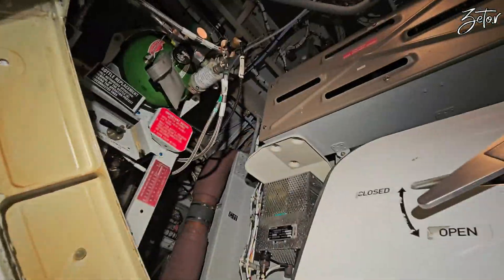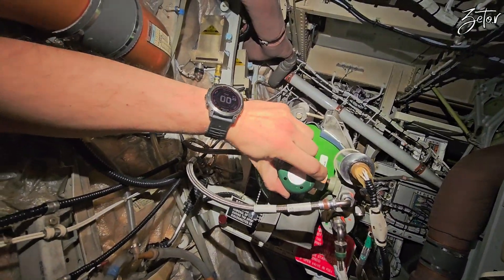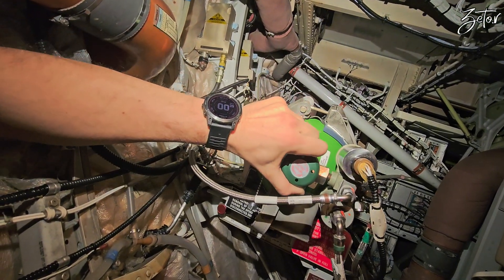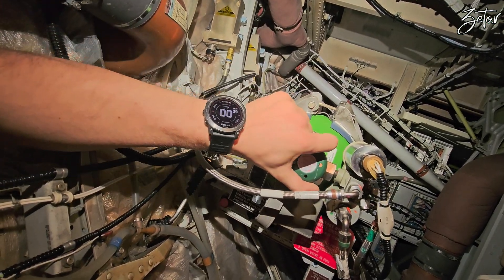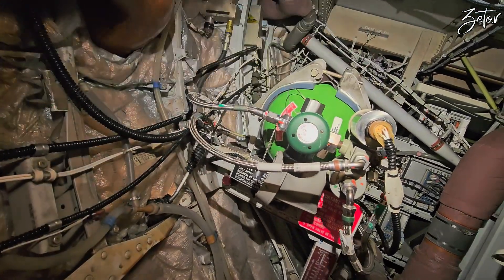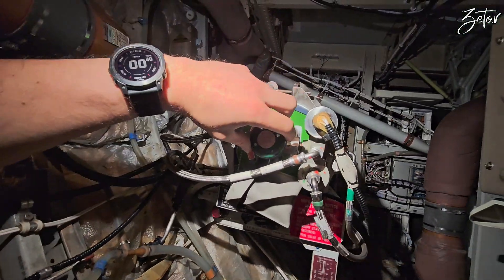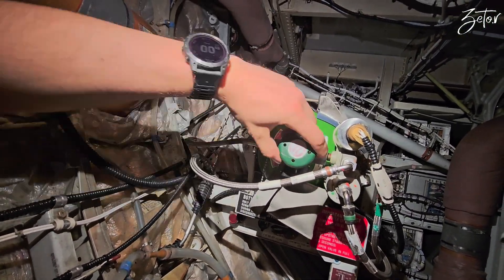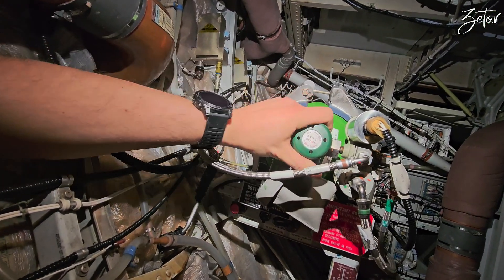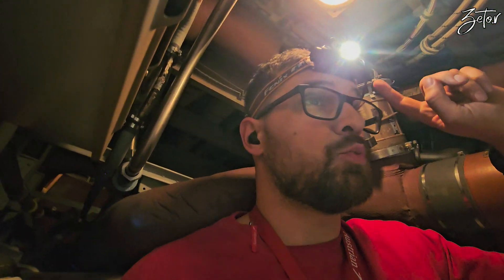Now we need to go down and open the bottle. Back in the avionic bay, we need to open the bottle, but slowly, to get pressure stable. We need to open it three turns - one, two, three - and wait nineteen seconds. Then open it fully. This way we'll let the pressure stabilize in the system. Nineteen seconds past, so we can open it fully.